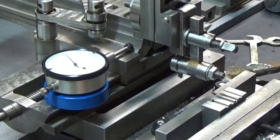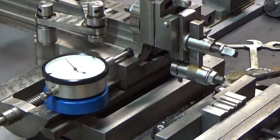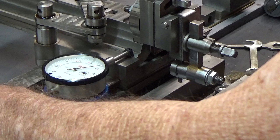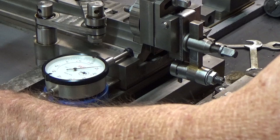I notice this thing has moved — I had it set at zero and it's moved a few thousandths. I don't know what's happened there. I don't have a way to lock the carriage right now — I've been talking about that for a while, but I've got to disassemble everything to get that job done. So that said, let's go about fourteen thousandths — I know this doesn't exactly work out right, so I'm going to go another three or four thousandths.